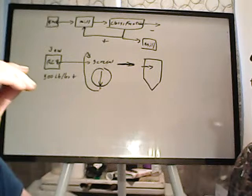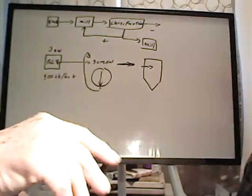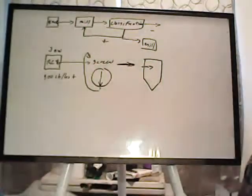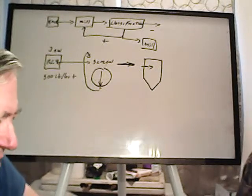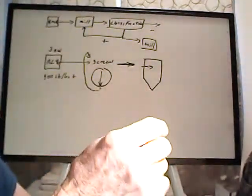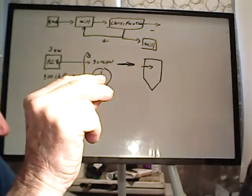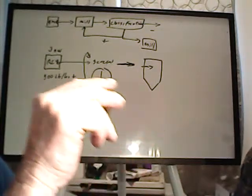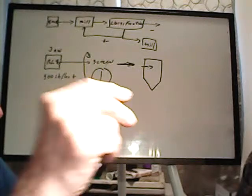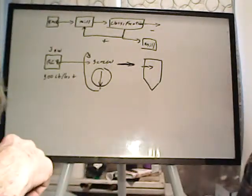The furnace element failed, and the manufacturer answered my email and said, well, there's stuff on it. It's obviously soot or gotten coated with whatever. And so the theory he's running on basically is, I presume, that as you coat it, it can't cool as well. So the actual temperature of the wire goes up higher. Ahead of it or behind it, one or the other. Yeah, and therefore, because it forms like a little insulating coating on it, now that it's running hotter internally, it loses physical strength and it'll start sagging and stuff like that.